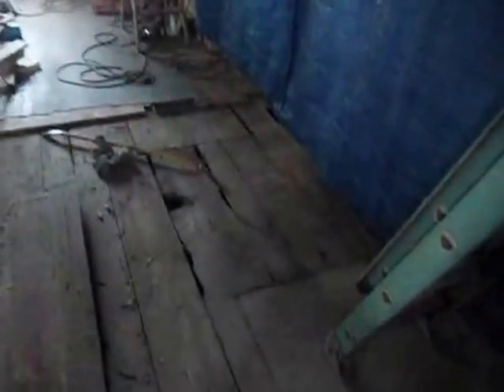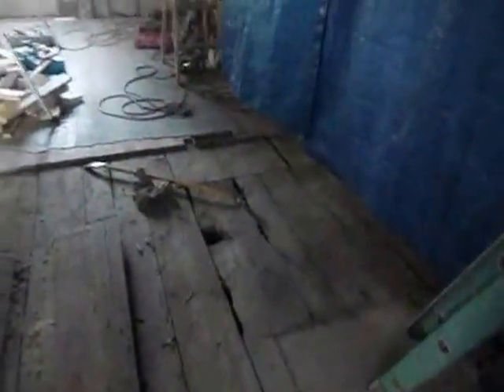I need to take all the floorboards up, which I'm doing first here. Beneath that is the subfloor — next to that hammer — that comes up, then the joists. Once the joists are up I'll reposition them to make a new opening, three foot by eight foot roughly, at the base of this ladder right here.